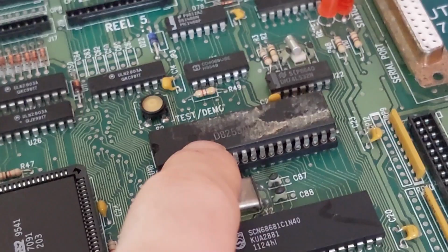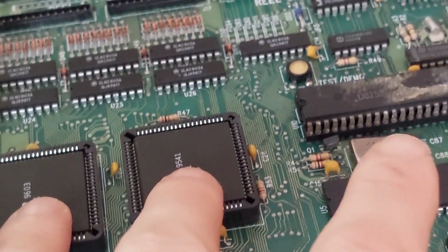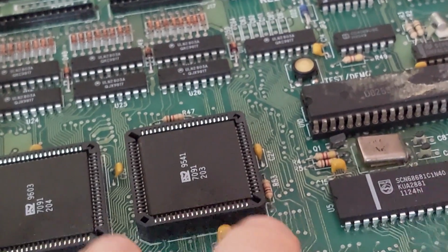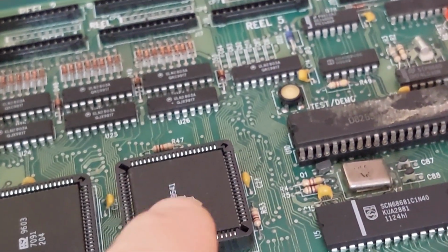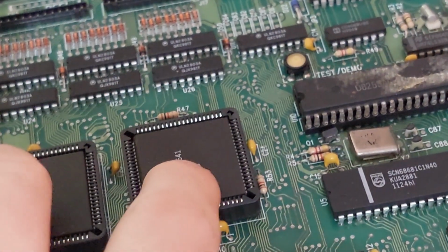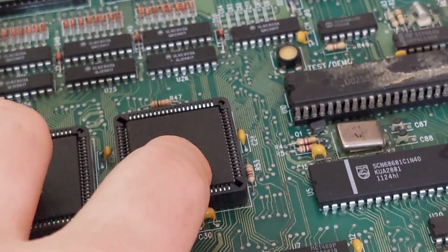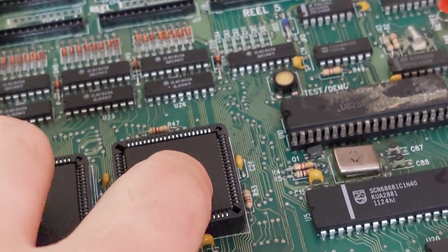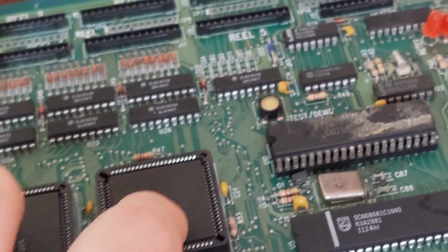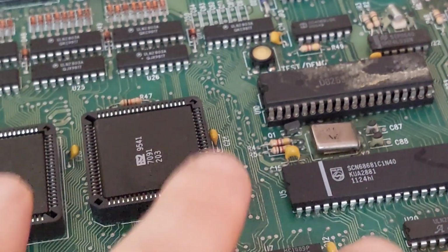Before I send the board out to anyone, it's going to get a new 71055 in it. And these are my spare chips, but I think I'll just leave them in here, because what will happen is, when this board goes to wherever it's going, the U1 and U2 chips are in the board that's coming out, and the board that's coming out is a green corrosion infested nightmare, by the way. To give you an idea of how bad it is, most of this top stuff's green and there's burnt tracks here and stuff. It's been lying in a cold environment for a while, cold, damp, whatever.